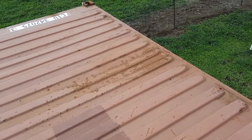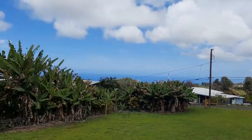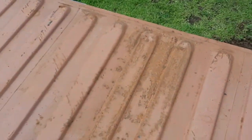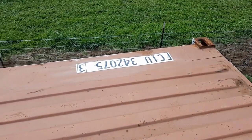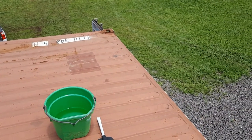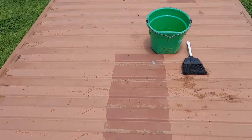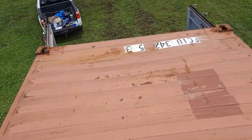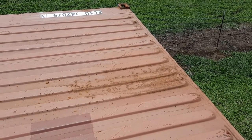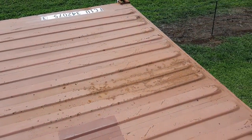The next part of this container project is the roof. I'm up here on top of the container — it's high up but I've got a stunning view of the ocean, north to south. I came up here a little while ago with my scraper, scraped off all the rust, got a couple of low spots that hold water. I'm going to sweep off all the rubbish off the roof, wet it down, wipe it, let it dry, and then start applying the waterproofing. I got a damp proofer — it's a black asphalt sealer, Henry's — and then a white top coating.